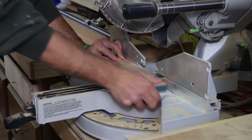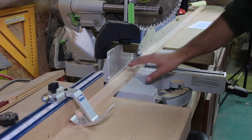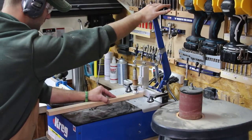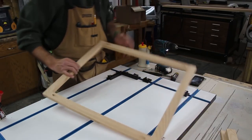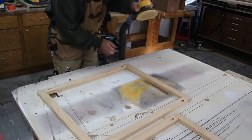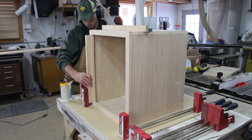I should note I am making two cabinets of the same exact dimensions. I remove the snipe received at the planer and rotate the material to put the square cut against the stop block. With all the face frame parts cut to length, we can now drill pocket holes at the bench top pocket hole machine. Once completed, we head back to the bench and assemble the face frame with yellow wood glue and pocket screws — one screw per joint. I hook my dust collection up to my sander to sand the face frame smooth and even out the joints. To attach the face frame to the carcass, I apply yellow wood glue and apply even clamping pressure with the help of four cauls and a bunch of parallel clamps.